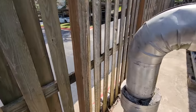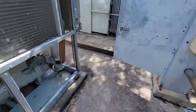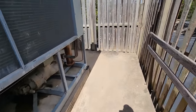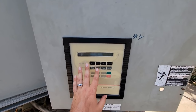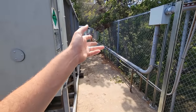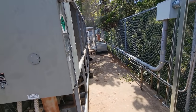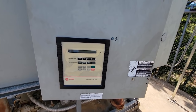His automation is not calling — I heard the pumps shut down. His automation switched to the other chiller. Let's manually turn that one on. The way these are set up, they get start/stop from the flow — the automation turns the pump on, gives us chiller flow, it sees that as the start/stop closure contact, and then it's about to turn on. So far so good — circuit two is pulling us down. I'm just waiting, it'll bring on circuit one with the load. I'll let it do it naturally, I'm not going to force it.